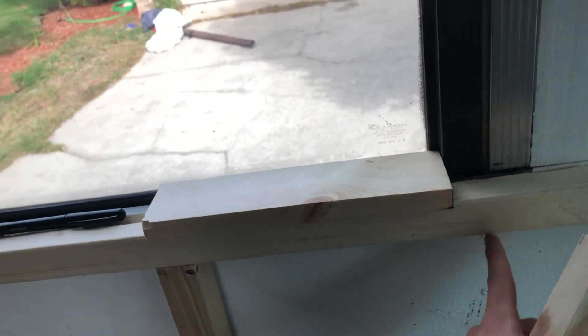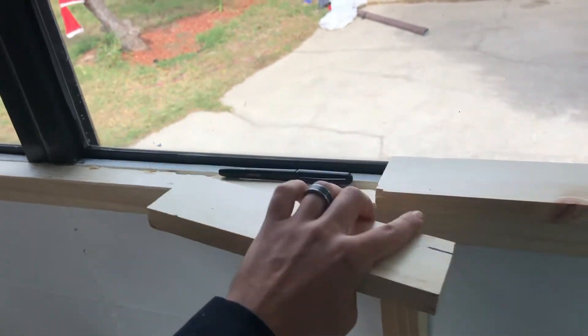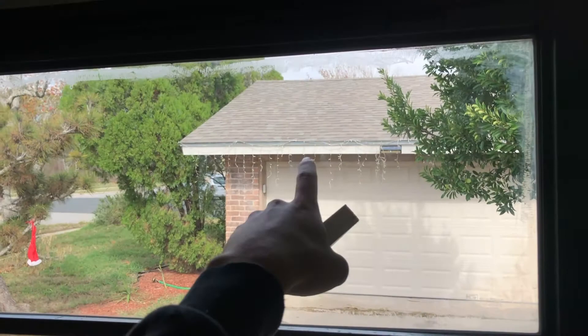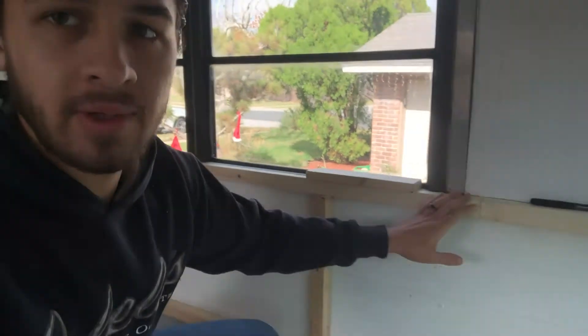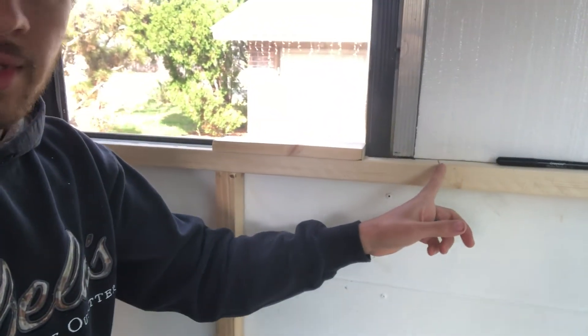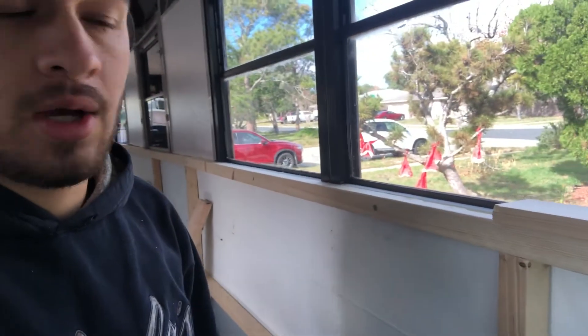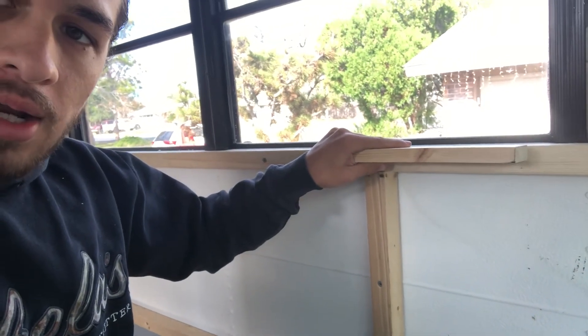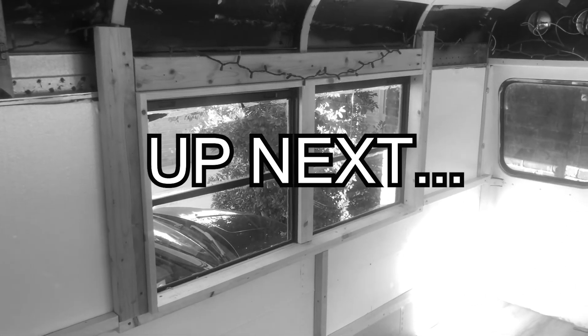So now I have to cut right here and right there all around the windows - make it a little lower so the trim can fit and we don't have that problem anymore, and the window can still open and close like we want. I'll mark these lines, cut right here and back there, and just lower this beam where the windows are - I don't have to lower the whole entire thing. That's all for this week's video - next week we'll be showing how we did our window frames. Don't forget to like and subscribe.